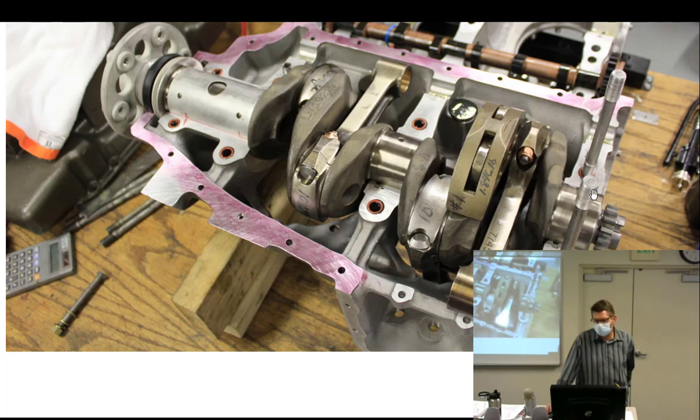So when you put O-rings on, I had little O-ring installers, which were just little caps that I had made out of phenolic that would just barely slide over and had a little point, like a little cone. And so the O-ring would just go over the cone, slide down the little slippery thing until it got to about this point and then rotate down. But if you don't have those, it's no big deal. I just take the package that the O-ring comes in or a piece of binder paper, rip it, wrap the binder paper around, put a little twist on the top, and just slide it across the paper. It's no big deal. Yeah, electrical tape can work too. Anything you want that protects the O-ring going down. Just take time and care.